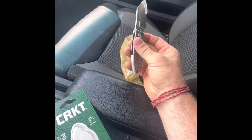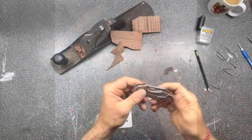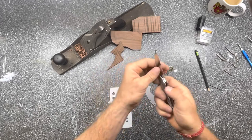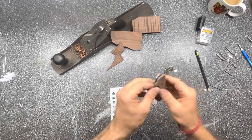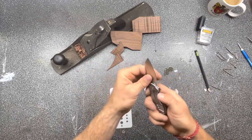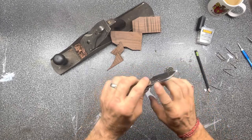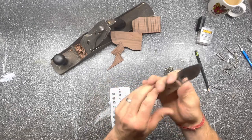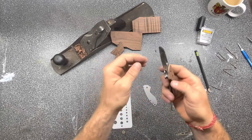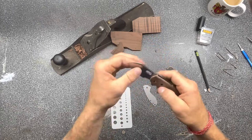Probably a lot of heat. I carried it around a bit, felt some things I want to change, took it apart, cleaned it, sanded it, made the action a little better. What I'm looking at is crowning the spine, crowning the finger choil a little bit to make it more comfortable. And I want a button — not a button lock, but a button release — so I'm not digging on the frame lock all the time.